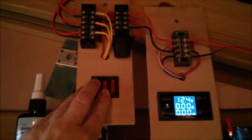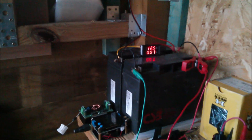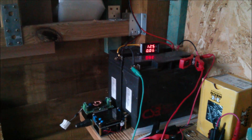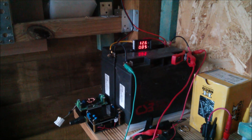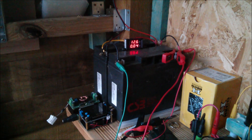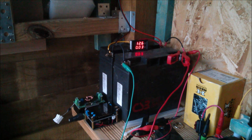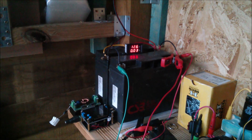There's a voltmeter on there, then a cable that runs up to this panel with another voltmeter — they don't all quite agree. This is my lighting panel, so I can turn those lights on, those lights on, or that light on. I've got three separate circuits. At the moment this system is just about coping — it can just about provide me with a couple to three or four hours of lighting energy from these two batteries, which ultimately comes from the power wall every couple of days.